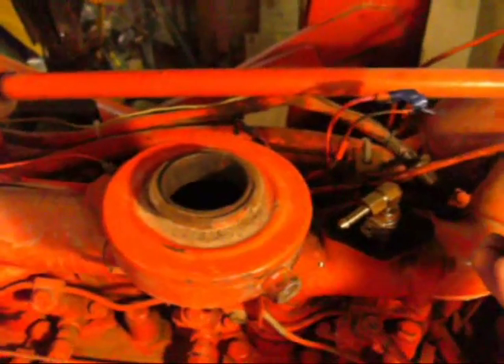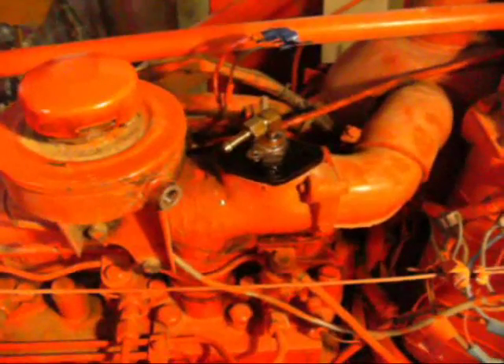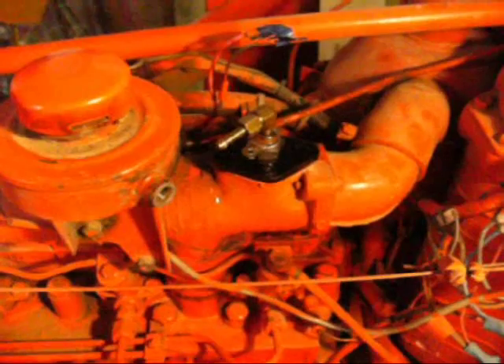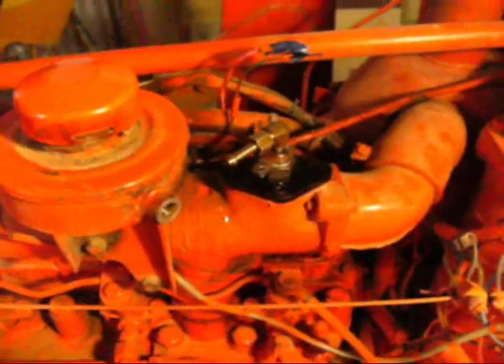This little fuel container is designed to have the diesel put in there — maybe a cup full of diesel that sits there. You only need a dribble of the stuff to start the machine each time you use the flame starter or thermostarter. All I have to do is bolt it in there and figure out how to connect up all the wiring.